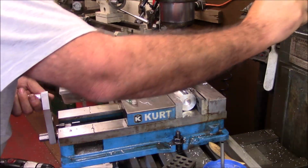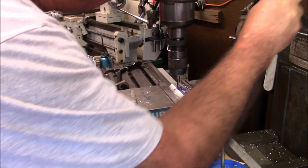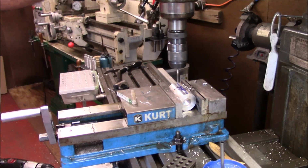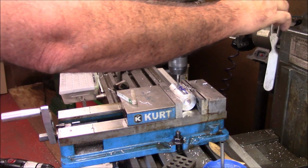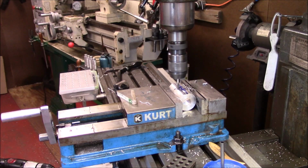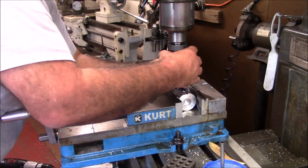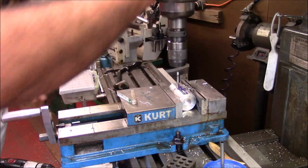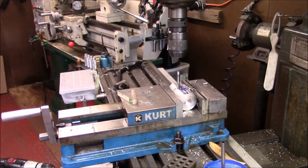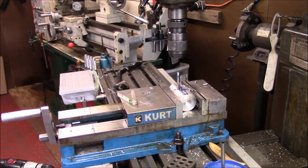That's awful funny. That part looked like it moved. Maybe it wasn't quite perfect. So I'm just going to start it and unscrew it and get my tap wrench and back the tap out. That's just, or tap it and then back it out. Safety feature, because that's a blind hole.